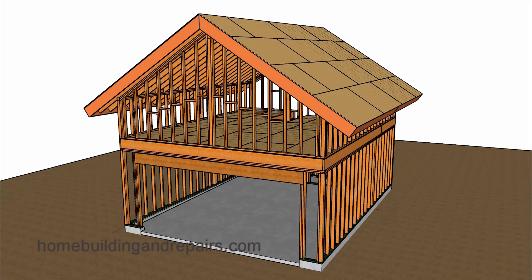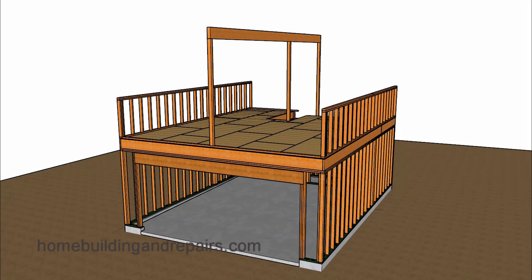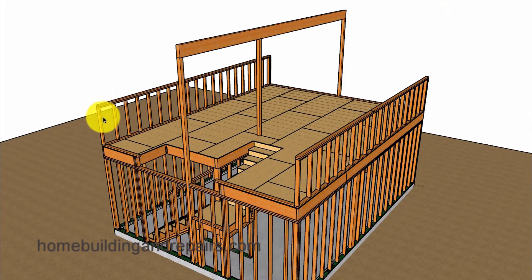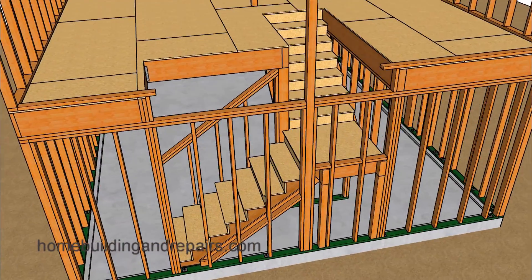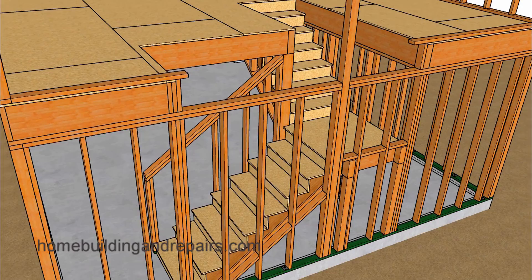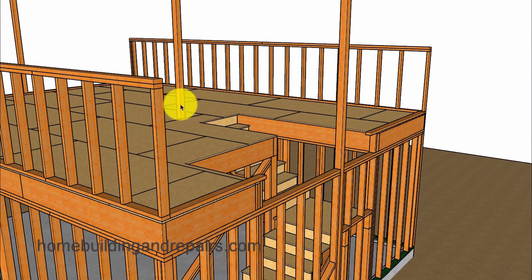Here is a video that will be helpful for anyone who needs to figure out the post height that will be supporting a ridge beam for either new construction or even remodeling. The height of the walls will not matter because we will be adjusting for them depending upon whether the post goes all the way down to the bottom plate on the first floor framing or whether it is going to be sitting on top of the floor sheathing.